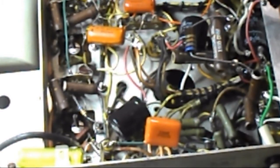And we'll show you the other two sections here. Right there, that is what was clipped off on one side, and he put an extra wire here to that. Okay, so this is the positive side, and on the negative side, he ran another wire from here back over the negative side. The negative side actually is hooked up with the original wiring in there to the other capacitor. So that's one thing. I'm just going to unsolder that, and I'll solder that back onto the negative side on my new electrolytic.